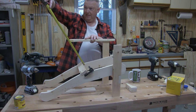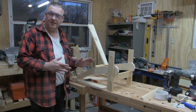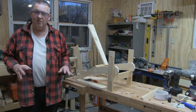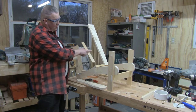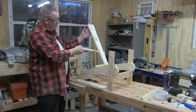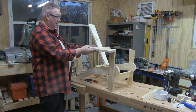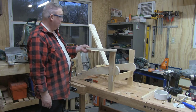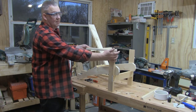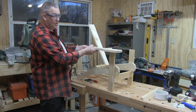This is one of those interesting moments during a prototyping session where you realize things aren't quite how they need to be. This part here supports the backs — there'll be some screws going through into these to secure them — and this is where you tie the back part to the arm, so a lot of strength comes out of that design. What I've realized is — and you can probably see it on the camera — this is way too far back. It's going to look wrong. I'm a good two inches short on these arms; I'd much rather they were well forward like that.